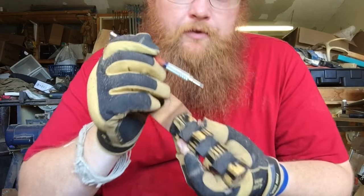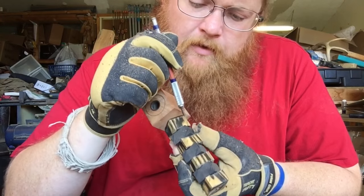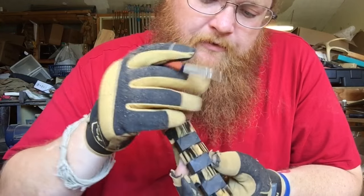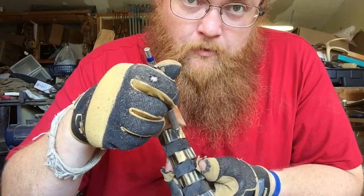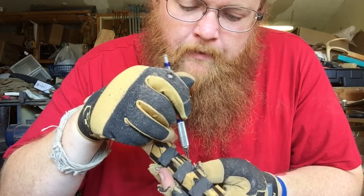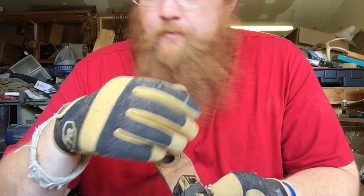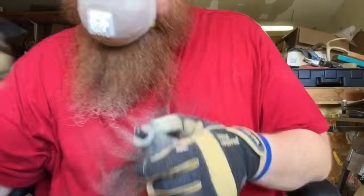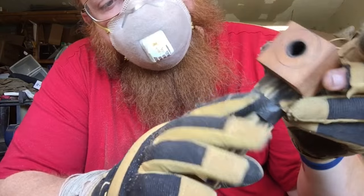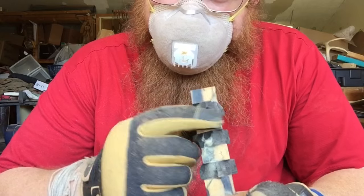So the first thing you're going to want to do when you're actually creating the twist and sanding this down and shaping it is along these sort of lanes that you've made with the twist, there's these corners. There's one here, one there, one there, just all the way around. You want to knock those corners off before you can really start shaping it. Okay, so you can see I've taken off the corners along here. It might be a little easier to see now what I was talking about.